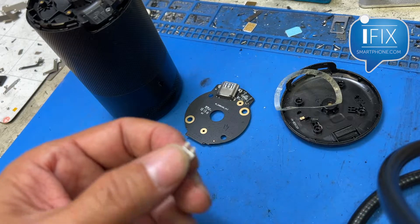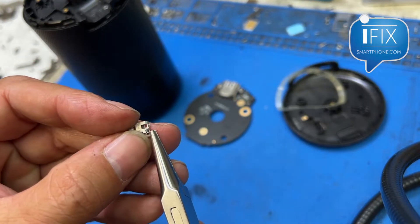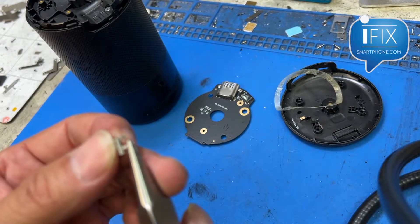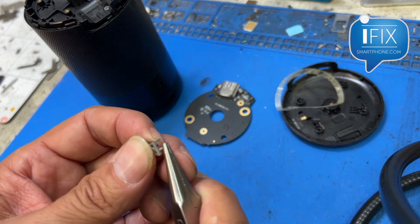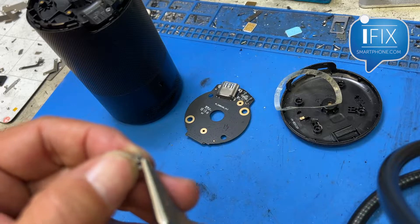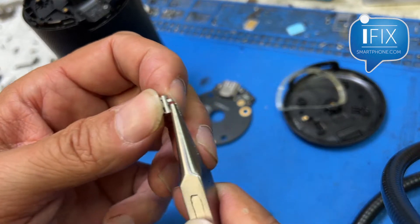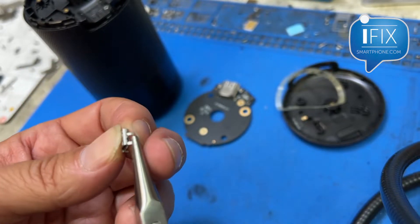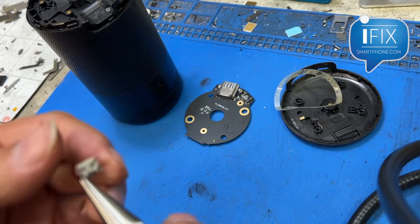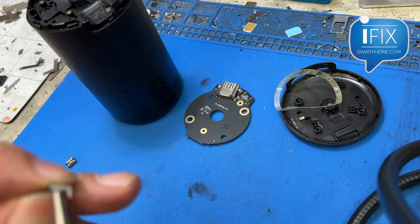If I can just kind of bend this, I can fit it in. It's pretty soft material, so I just make sure I use my holder and bend it. I think it's a pretty similar size, and if the hole doesn't let me put this in there, I just have to adjust it. I just need to get this leg into at least two holes in there, and I believe that's going to give pretty good support. So this is how I do it — getting it close, making sure it comes straight down, getting it to 90 degrees.